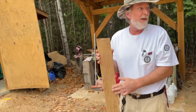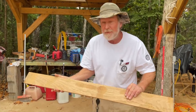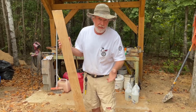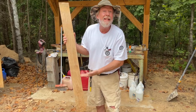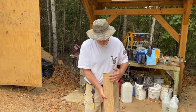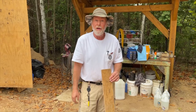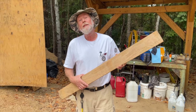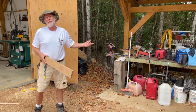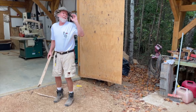At this process we're not trying to plane it to be a perfect board — this is perfectly fine for where we're going to start. We're going to have to do some more planing or sanding later. To be honest, when I've stained this stuff it looks beautiful, it looks rustic. Really you just do both sides of your board — all you're trying to do is get everything squared off. Then we're going to take all this down to the shop, show you how we glue it up, and show you how a cabinet is actually processed. Simple, easy.